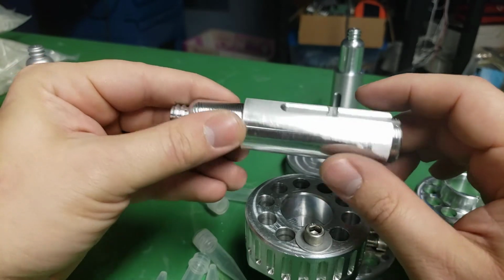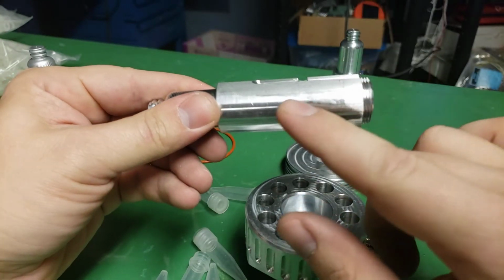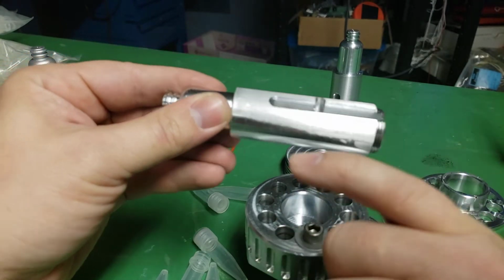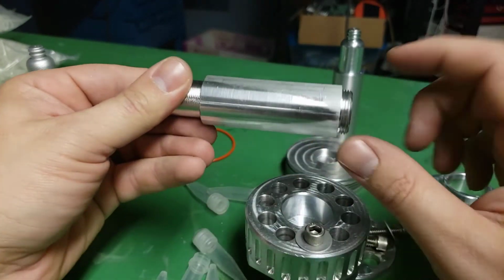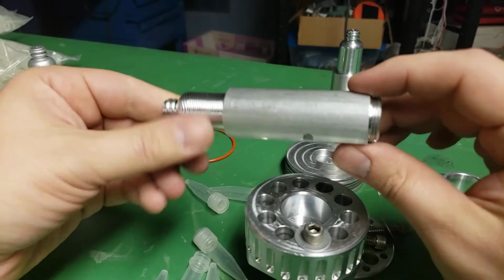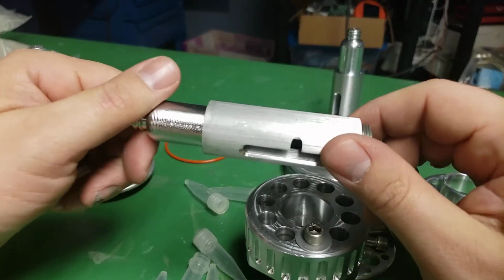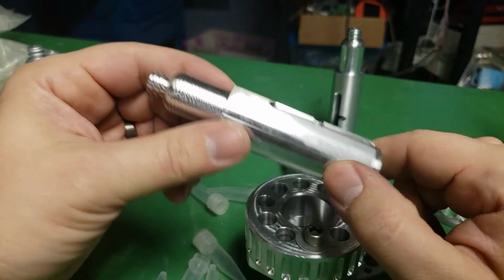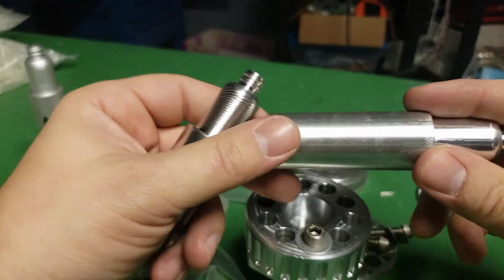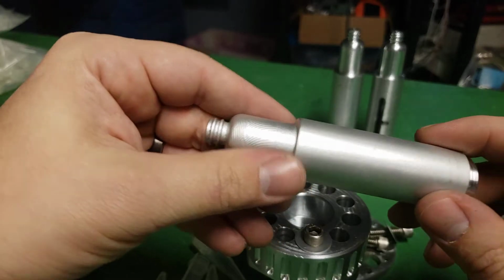This one you can see as well. I started with 1-inch bar stock, and I took a little bit off. I was wanting to clean this surface up and make it prettier, but because it's just a tiny bit out of round, when it was rotating, it would cut here, and then it would stop cutting, and then it would cut again. So I made this diameter just a tiny bit smaller, and that lets it cut all the way around. And then I tested sandblasting this one.